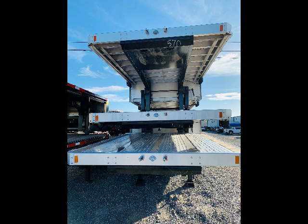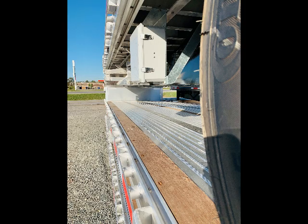We've got these trailers set up with an 11 foot upper deck, 24 inch kingpin settings. On the front you'll see your standard seven-way hookup with your glad hands. We can do anything and everything — we set these up in the shop quite a bit with dual air and electric hookups, which would be underneath those main beams in the center.